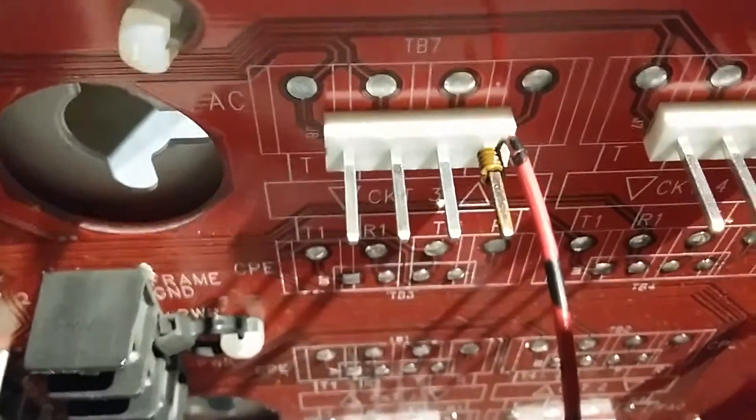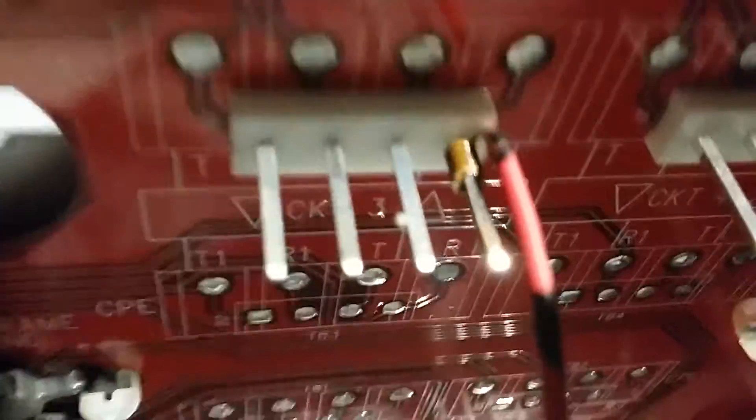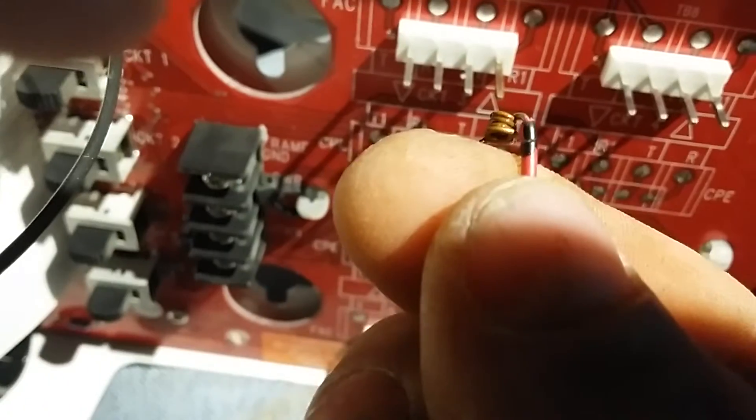I'm really not satisfied with the way this is turning out, but I'm going to go ahead and just upload it. This is how they make connections in the central office and on more higher-end equipment like this, because that's actually a pretty stout connection. The unwrap tool is much simpler — you slide it over and give it a few turns like that, and it just pulls right back off. It unwraps and untwists it and leaves it like that.